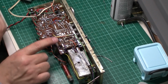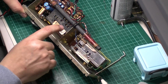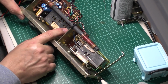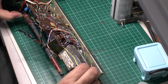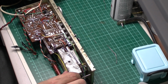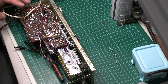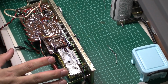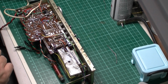Switch bank back in. Module in. Now, this is my replacement module, which has got the AF127s in it, so no expense spared there. 3 AF127s have been put in that to rebuild it, and all the electrolytics in it have been changed as well. So the diodes were checked, so that's had a full refurb, that module.